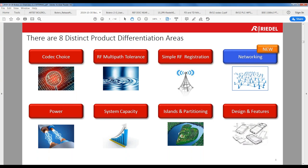The great thing about this system is that because it has multiple antennas in its array, and those antennas are fashioned in different geometric planes, one being vertical, one being horizontal, offset in what we call the Z-axis. What that means is basically we're catching more signal coming from the device that's radiating towards us. So if we're a belt pack and we're transmitting towards an antenna, the antenna is going to see a lot more signal, and it's going to see a lot more variation of signal.